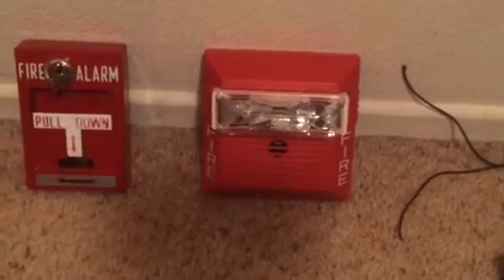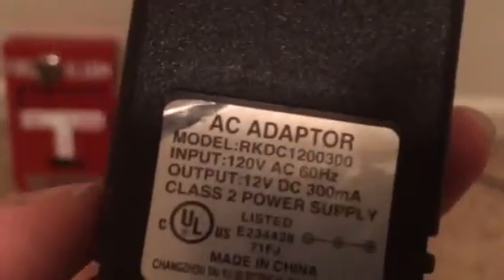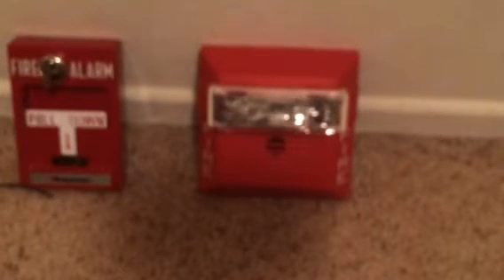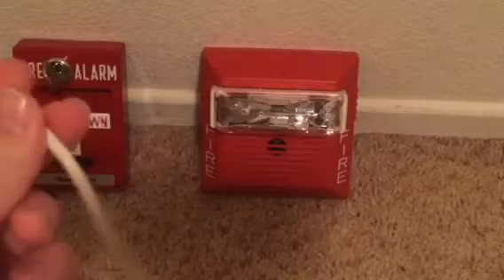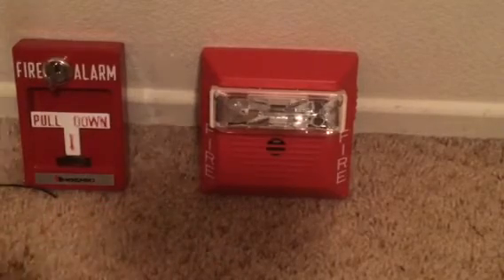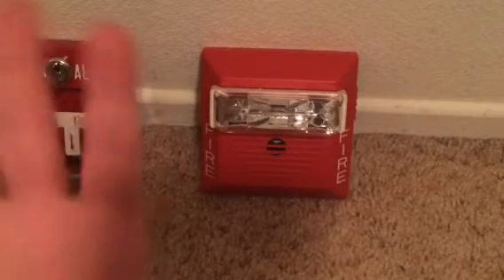So the things you'll need: a pull station, an alarm obviously, and a power supply. This one is 12 volts DC output — the input is 120 volts AC and the output is 12 volts DC. You can also use a 24 volts DC one, which probably works better for your 24 volts DC alarms. I stopped using batteries because they die really quickly. You also need a Phillips head screwdriver — Phillips head works best. And you need just some wire. You can go to the hardware store and buy speaker wire, cut an extension cord, buy them online — there's a lot of places you can get wire.